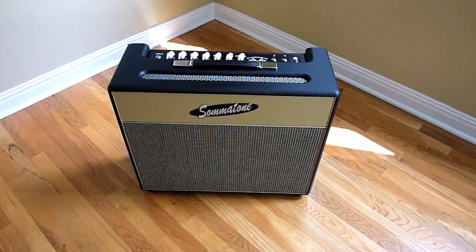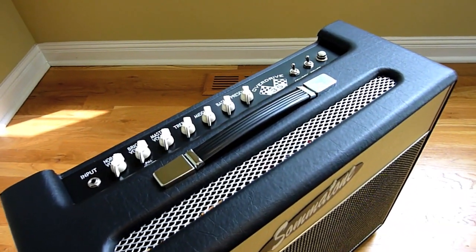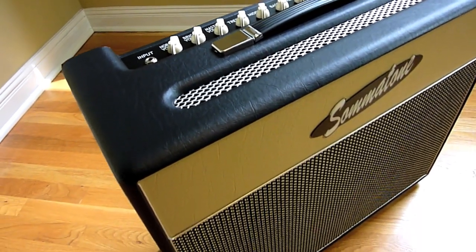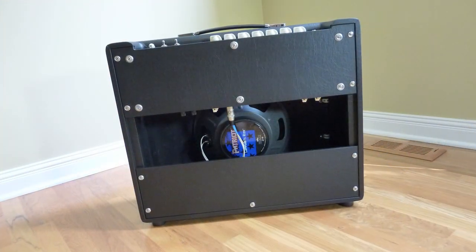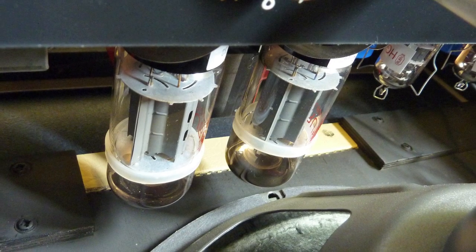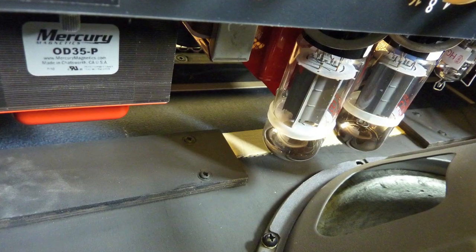The Overdrive 35 is inspired by the tone and features of vintage tube amps, but has its own style and character. The versatile circuit can cover a wide range of colors, from shimmering articulate cleans and throaty mid-gain tones to harmonically rich overdrive. Features include true point-to-point military spec construction, silver-plated Teflon wiring, two 6L6 power tubes, five 12AX7 preamp tubes, fast recovery rectifier, and custom Mercury Magnetics transformers.